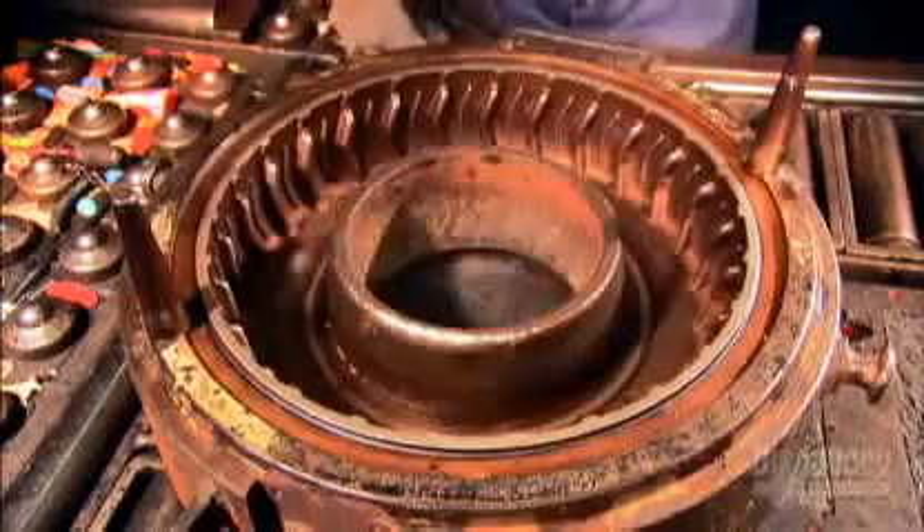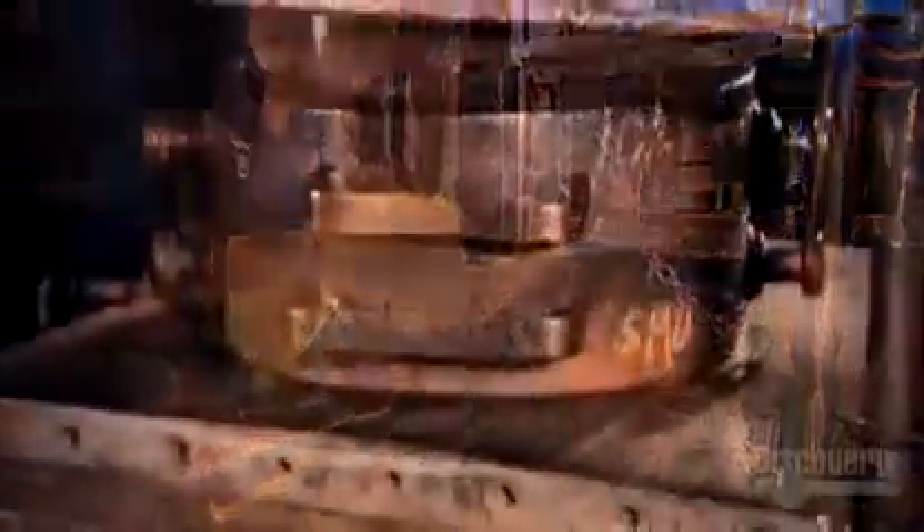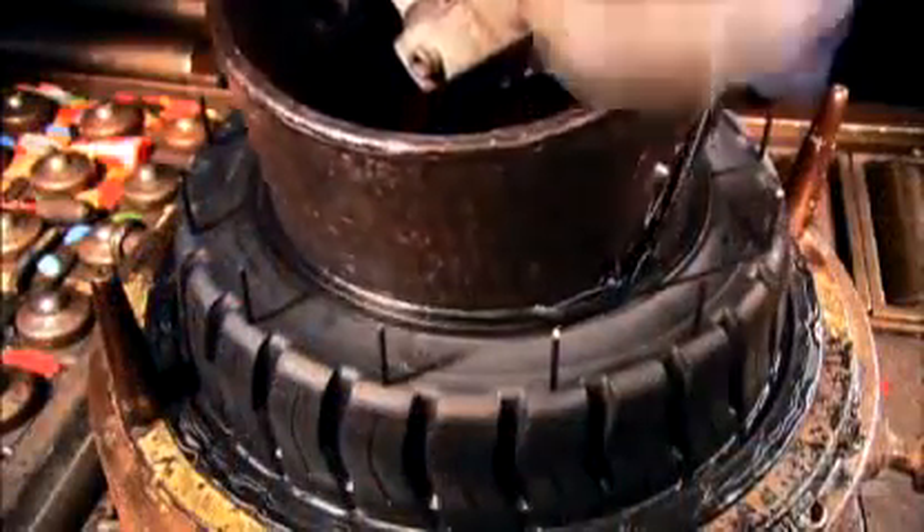These tires need some tread. They begin by spraying a release agent onto a mold so it will be easier to remove the tire later. Then they lightly glue the ID label and serial number plate to position them for transfer to the tire. They center the tire in the mold with a metal ring and lower the top section of the mold onto it. The mold is then hoisted to another station, where it is sandwiched between two steaming hot plates. The hot hydraulic pressure melts the rubber into the crevices of the mold. The rubber cures in minutes, revealing a treaded tire. This process also vulcanizes the rubber — a molecular change that strengthens it.